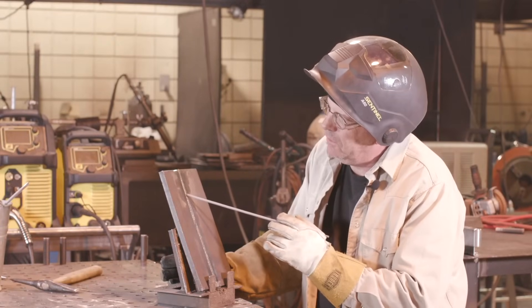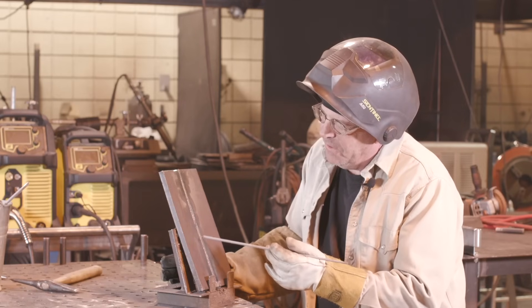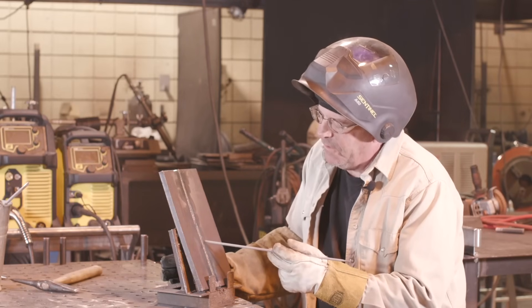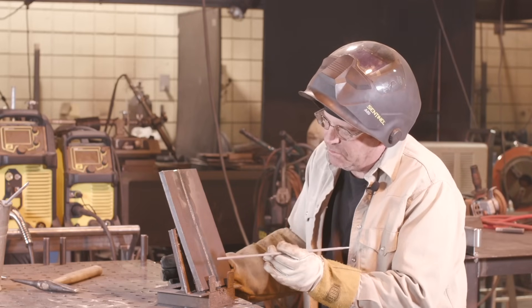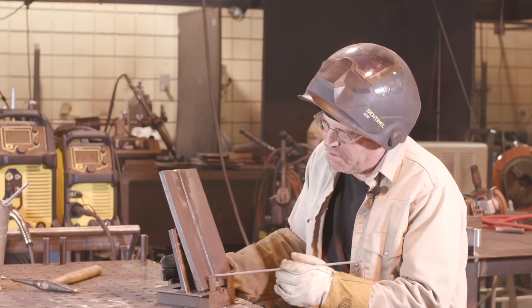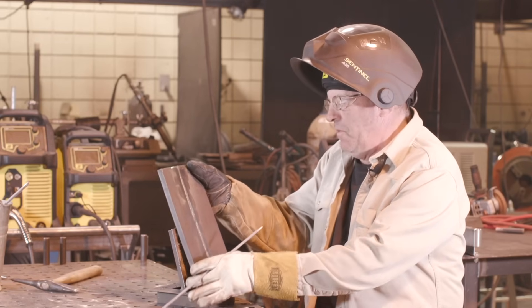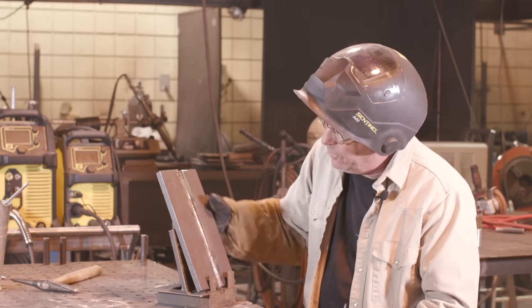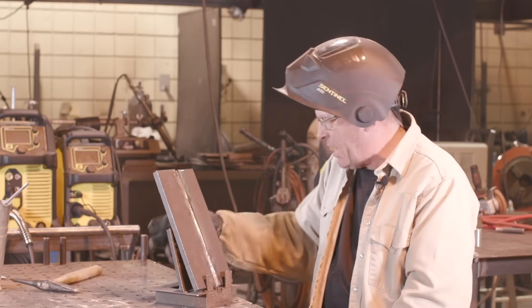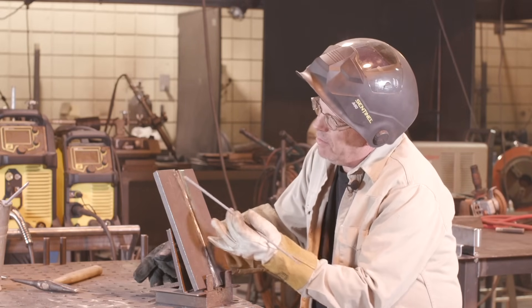I ran the root in here. I've got a decent profile where I started with the 1/8-inch. I came over here and it was getting away from me, so I turned it up a little and went to a 5/32-inch. Got down here where it closed up again, went back to the 1/8-inch. I've got one pucker mark up here where I snubbed out a little bit. Now I'm going to go back to a 5/32-inch 6010 and run a hot pass in here.